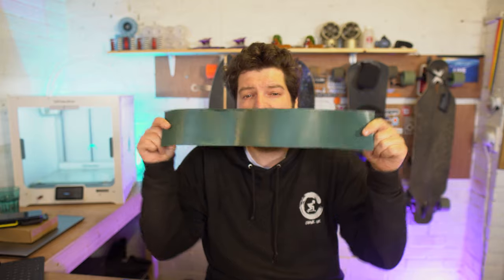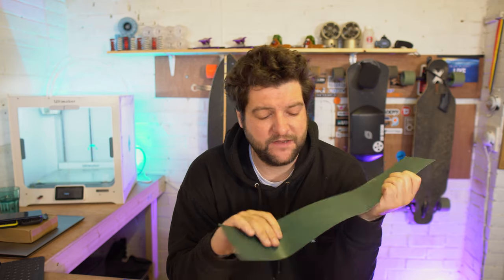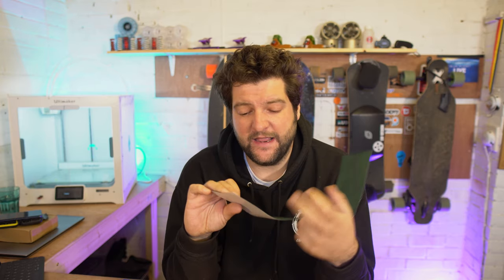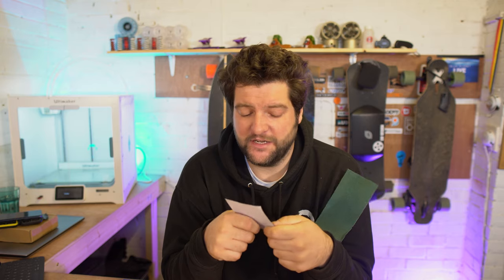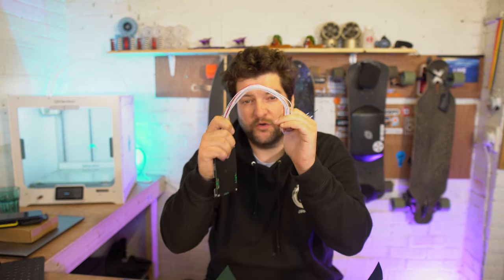When we talk about battery safety, we talk about fish paper. This stuff is amazing. It's anti-abrasive and also anti-heat, and it makes a really good barrier for stuff that could potentially short. The aim of the game when you're making a battery is to make sure nothing shorts. It's the worst thing that could happen to a battery. If any two connections that are connected to the battery in different places touch each other, you're gonna have a short. This is a figure I'm just making up, but I would suggest that 95% of battery fires are caused by these wires rubbing on each other. So we're gonna run these in a way that is safe and that doesn't happen.